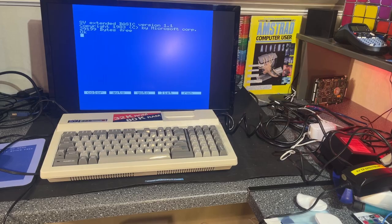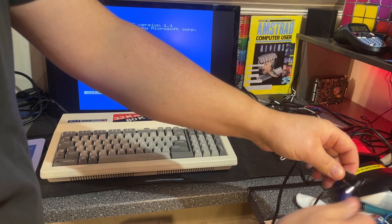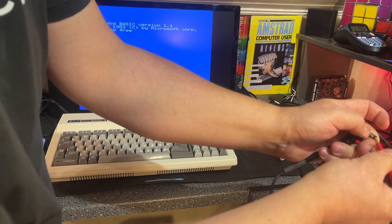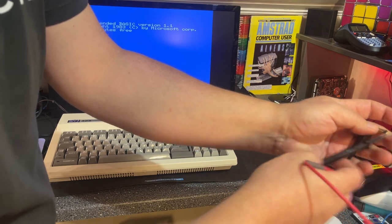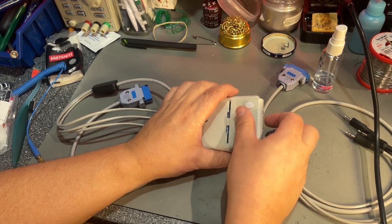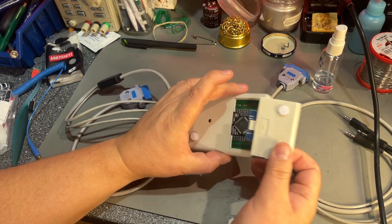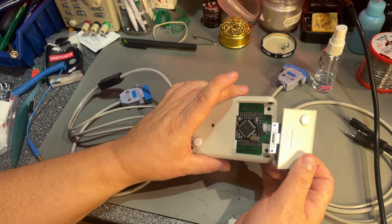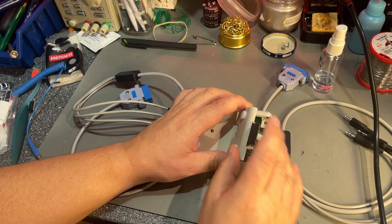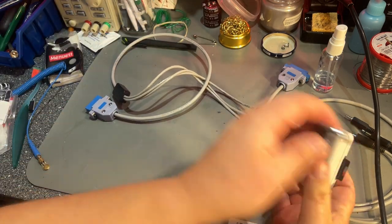It's time to test. I found a 9V power supply with a plug that you can turn around to switch polarities. I checked that it is in fact center positive - it's 8.99V plus. I've switched over to the SVI and we're going to test on that machine first. Here is the SD card which you insert - the case seems to be for something else as it has a battery compartment, but now it's just a holder for the SD card.